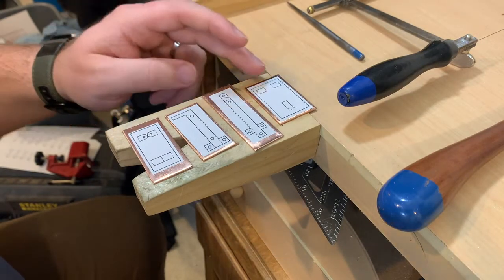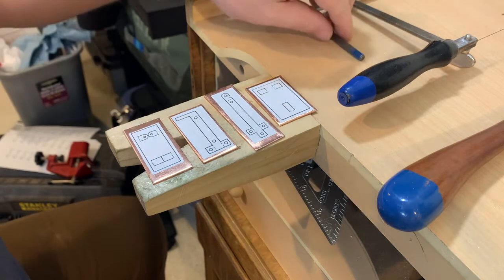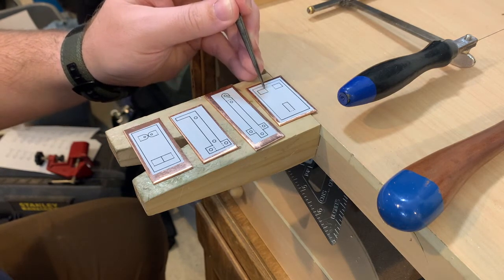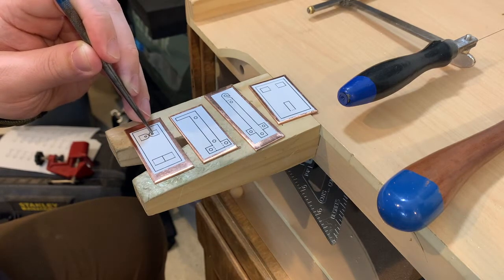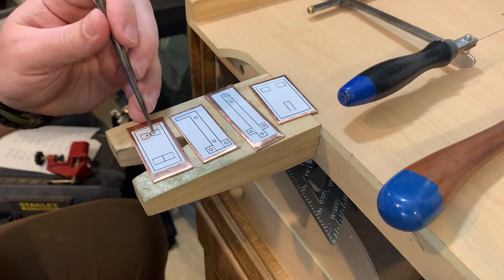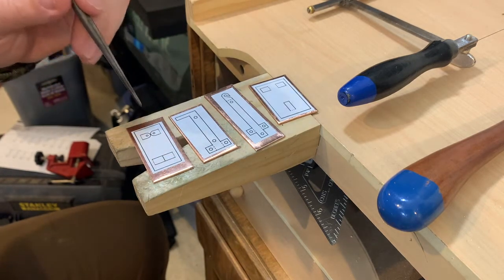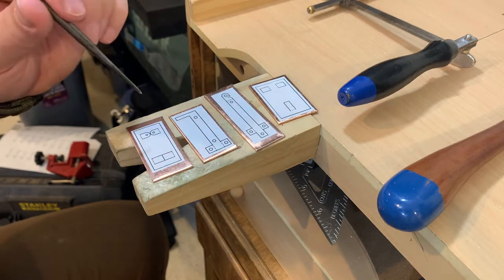To begin, I've taken my four sample pieces and glued them all onto my 18 gauge copper. I'm going to use my center punch to punch and drill a series of holes that I will use for cutting some of these sections out. On these two specifically I have to cut interior lines, so I will be punching a hole at one of the corners of each section to be able to cut the pieces out. I'm also going to punch and drill holes so that my pin wire can slide through and create the pivot point. When looking at these templates, some will have dashed lines instead of solid lines — those dashes indicate where the metal needs to be folded, so anywhere it's a dashed line you do not want to cut. That's a very crucial thing — if you cut through those, these will not function properly.